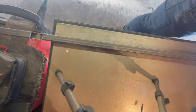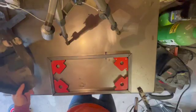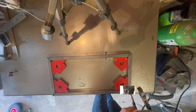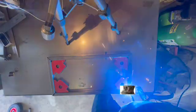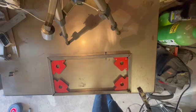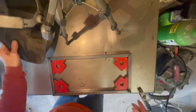So here you can see the cutout that's made, and we've done that all the way along the box section to enable us to bend it into one piece, as you can see here. So we've got that rectangular shape for the base of the trolley. We're using the welding magnets, which are absolutely fantastic, and Tig's the cat is acting as a little welding mask for you guys there so that we don't blind you.